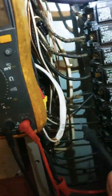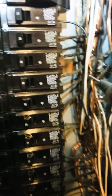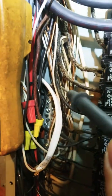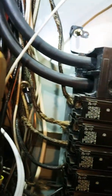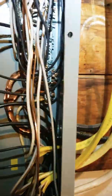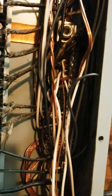I put the infrared on there — the neutral strap in the back is very hot. There's a neutral connection right there, very hot — it connects to this bar here. You can see the lights flickering. All the wire in here looks pretty good, a little old, but the main service entrance cable on the breaker was tight, the neutral connection was tight. There's your grounding electrode connection right there — it goes to the water meter, probably went to a ground right outside.